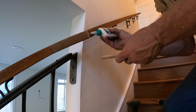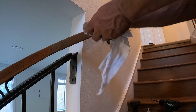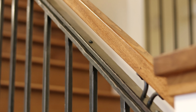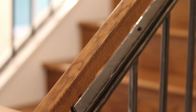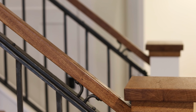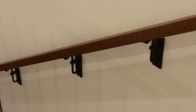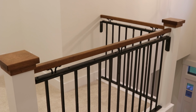One of the mantras, or sort of tongue-in-cheek guidelines of what it means to do blacksmith work, is that you measure it by eye, you cut it with a hot cut, and then you hammer it until it fits. But the problem is that all of the forging and fabrication on this whole railing project was constrained by the absolute necessity to repeat the sizes and the spaces and the shapes to a tolerance that was visually right. Visually perfect, really, allowing for handwork. But in reality, I am positive that if a machinist saw this and put a set of calipers on the work that I was doing here, he would either laugh or cry, because from a machinist's perspective, the tolerances are radically pathetic. But for a blacksmith, I think all in all, it turned out pretty good.